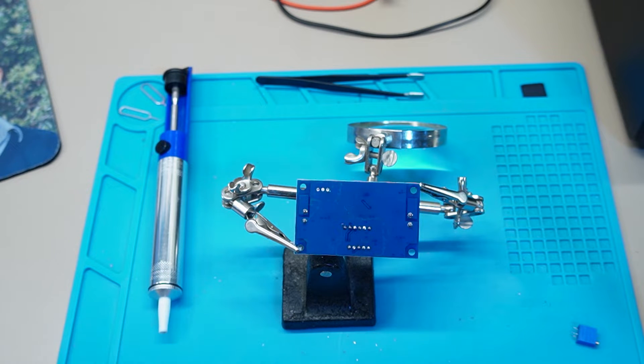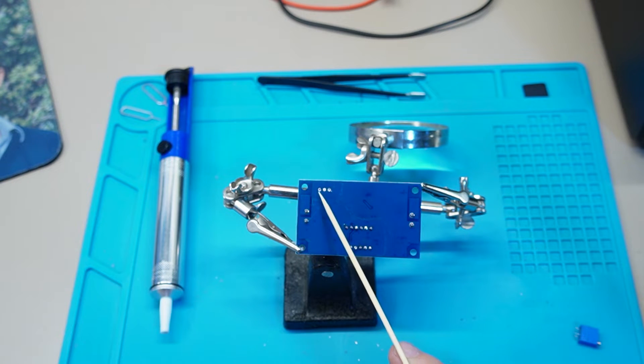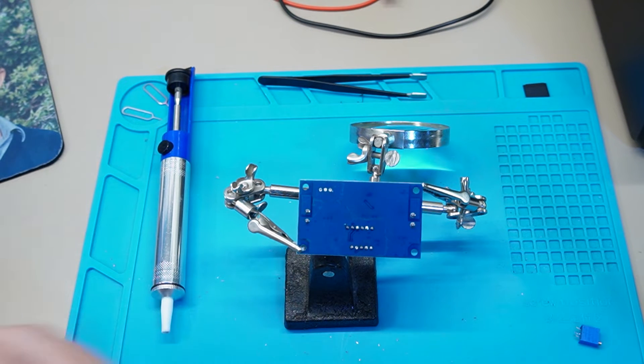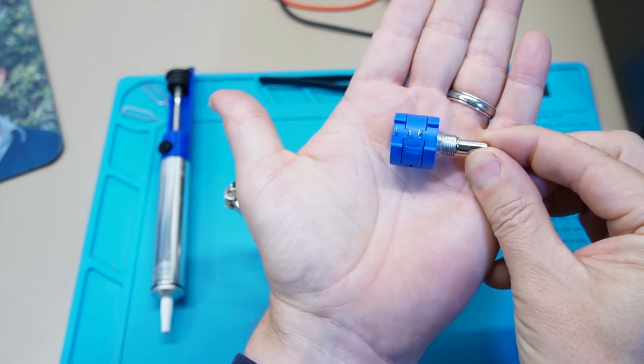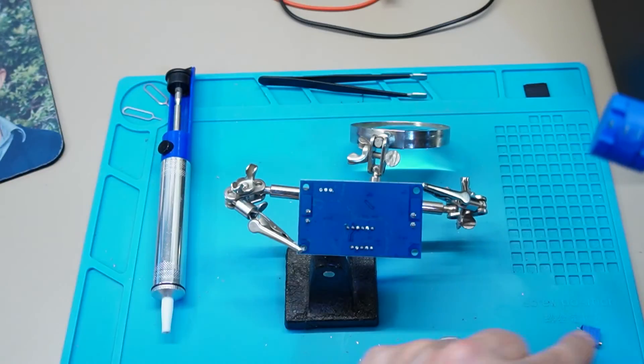What we need to do now is take these little traces or holes — I'll just quickly get a little drill and draw out the remaining solder ever so slightly, and then we'll attach some wires to that to attach the other potentiometer to it, which is this little guy. So we'll use this little guy to replace that.